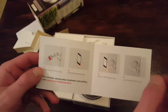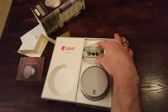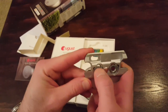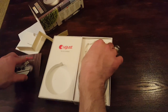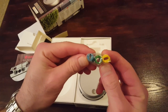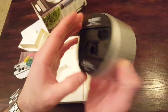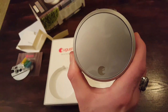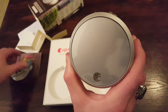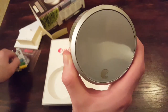That's about as simple as installing this thing is — just four steps — and we're going to go step by step through this together and show how easy this really is. Also what we got in here is a face plate. They used to give you three; this might be an adjustable face plate now. Instead of giving you three different ones, they give you one that you can tinker with a little bit. These slide into your locks depending on what style of deadbolt you've got, and the August lock will slide into that — and that's how you control your deadbolt. The cool thing about this is you don't actually have to remove your entire lock or uninstall it. You just pull the back of your deadbolt off, slide this on the appropriate one, put the face plate there, this in the middle — that's it. And the rest of it works on Bluetooth. There's no hub or anything for this regular August Smart Lock.